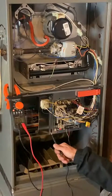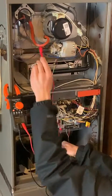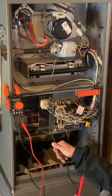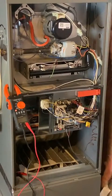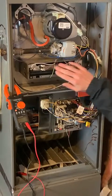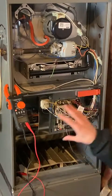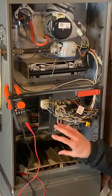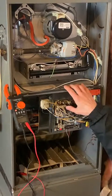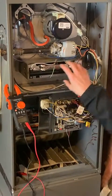That's the first set of diagnostic steps — check all temperature sensors, then check the pressure switch. If all these checks pass, the furnace proceeds to ignition. The first step in combustion — and the most noticeable — is going to be the igniter warm-up.